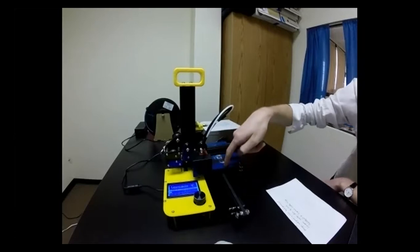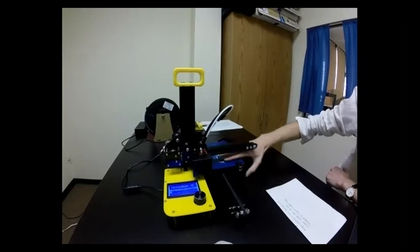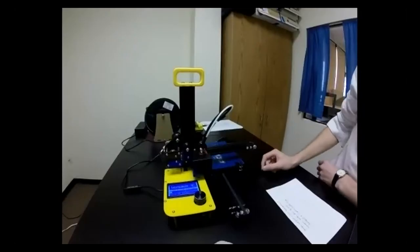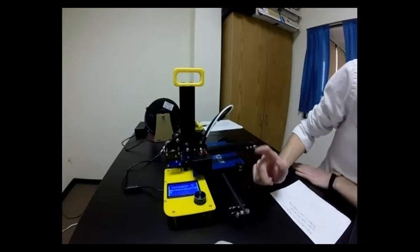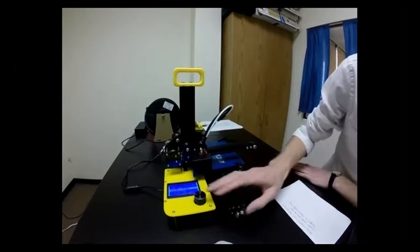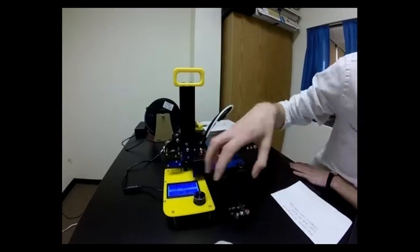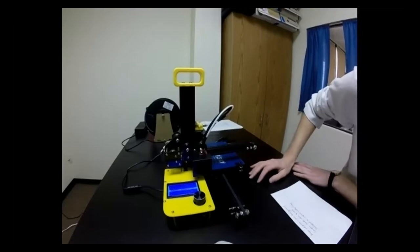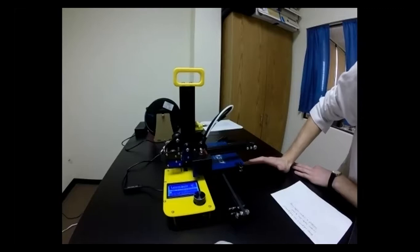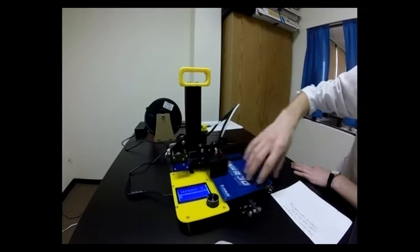The leveling process works by leveling the nozzle to the build plate, regardless of whether the printer is on a crooked surface — the nozzle will still be parallel to the build plate. After disabling motors, you should be able to move the build plate freely back and forth with little resistance. Now push the extruder assembly over onto the build plate area, take the folded paper and push it underneath where the nozzle is touching the build plate. The build plate is on springs, making it easier to slip paper under.